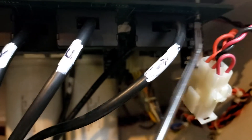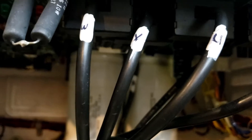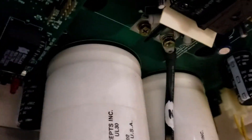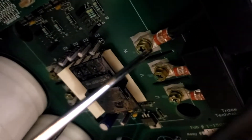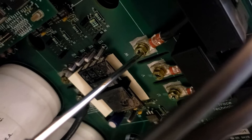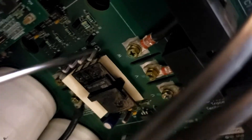This one has an arrow — we'll get back to why I put an arrow on that one. Let's go ahead and remove W, V, U, N. One thing to mention: the wire has a piece of heat shrink, but not all of them do. I've already removed the heat shrink on these. We need to remove the heat shrink so we can slide them out of the CT. Just use a utility knife, slice the heat shrink, and remove it — it's very simple. Go ahead and do that after you've removed all the screws.